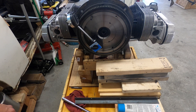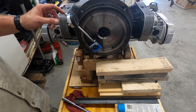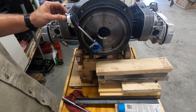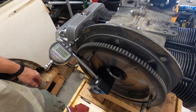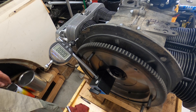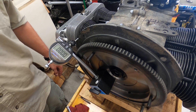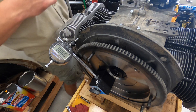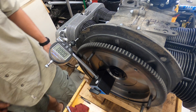I've got it set up now — this is a magnet base from Harbor Freight with a digital dial indicator. I've got it preloaded a little bit and it's not moving, so everything's good to go. I'll move the camera so you can see it. It's going to be upside down, but we're looking for three to five thousandths — that's it.